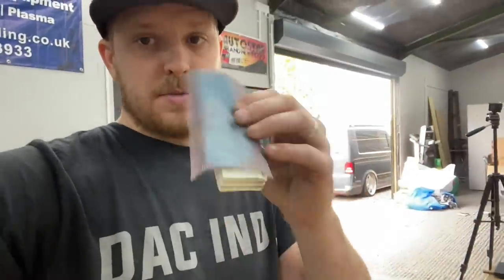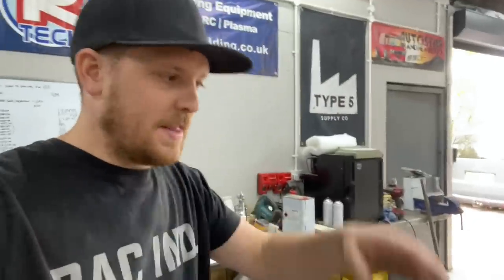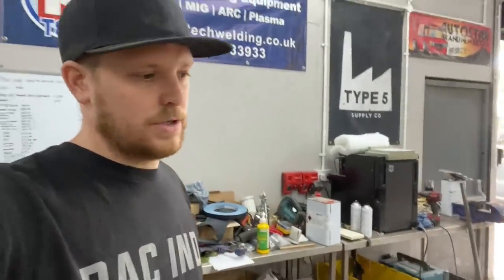Then we go over it with a block of wood and some sandpaper. This is 240 grit sandpaper, a little bit too much, really wanted 320, to then put an arris on the side, so a very, very slight radius, soften the edge, sand it back so it's perfectly flush. Easy enough to do when you know what you're doing, I suppose.